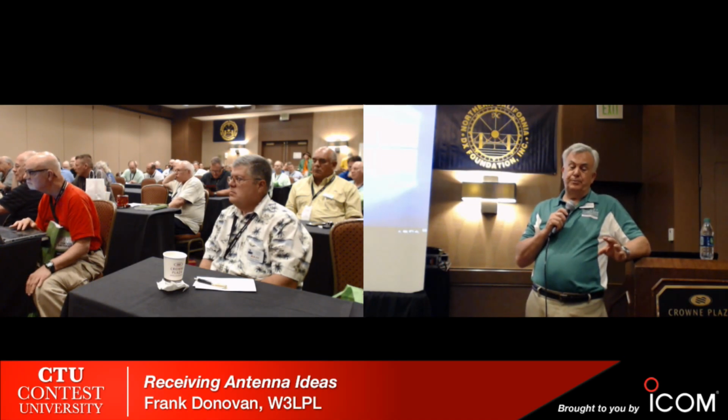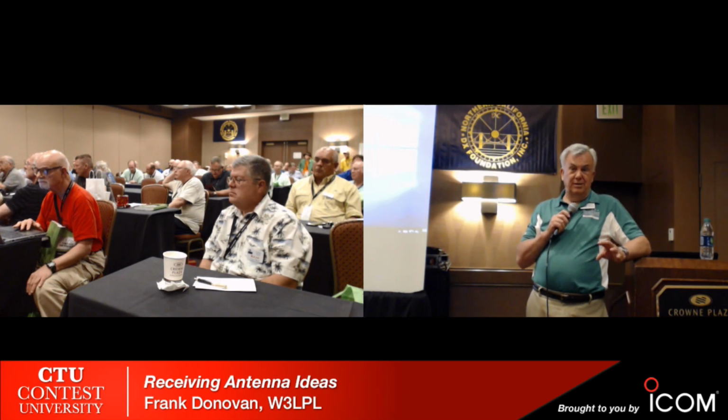There was a company called Hermes that built these small loop antennas and built them into arrays. In the professional world, they've been used widely. But personally, I've never used them. That company was very successful, so I assume there's some substance to it. Otherwise, people wouldn't have been buying them. They used to mount these arrays on tripods in a line, and then they had phasing schemes to vary the phasing between the Hermes loops.